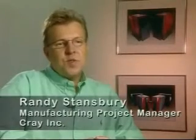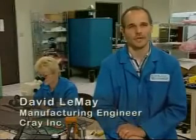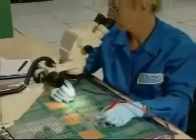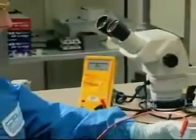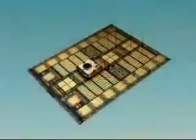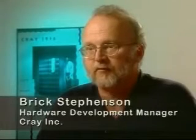The SV-2 is a highly manufacturable and testable product. We've leveraged the right mix of standard surface mount assembly and proprietary leading-edge processes to differentiate it. When we get our boards in from our printed circuit board suppliers, we'll do a number of tests — electrical verification to check impedance and other electrical attributes, as well as visual inspection for mechanical attributes. We've got a good balance of high performance leading-edge PC board that is also very manufacturable, which was key to keep costs down while achieving the interconnect required for high performance.